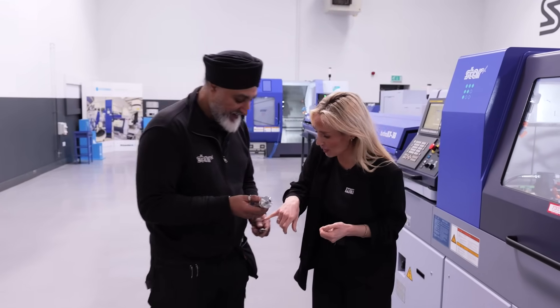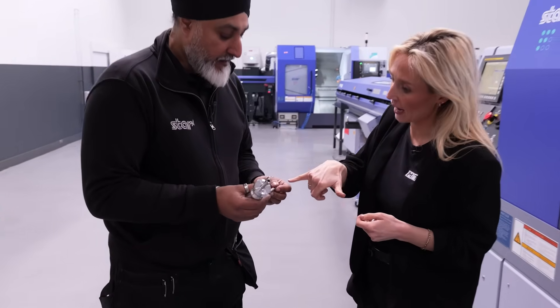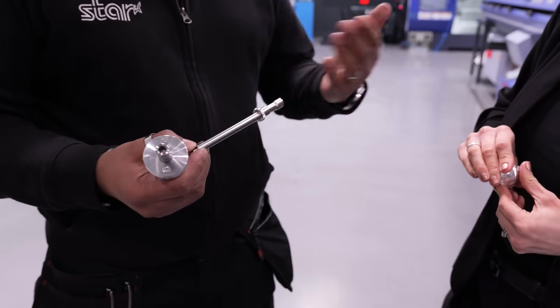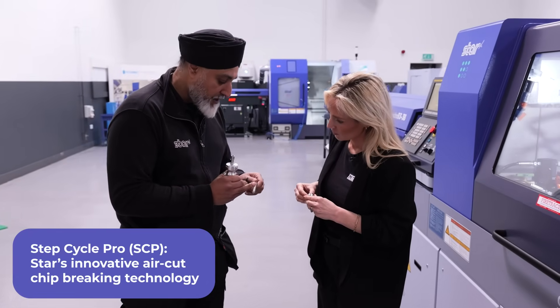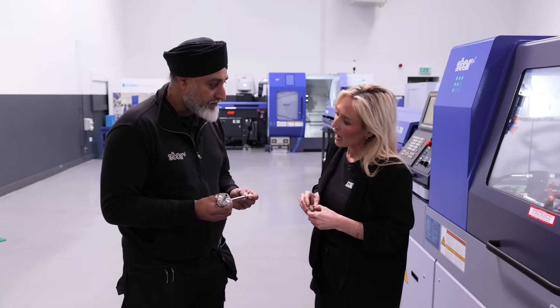The one with your name on it is back in the office. Just a quick question — is it tricky, because that's quite a long component? It is a long component, and being 316 stainless caused some swarf issues. So using the SCP technology on our machine, we used that to basically chip the swarf and still create the surface finish that was being run on the bearings.